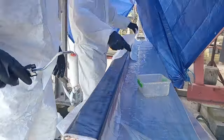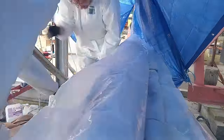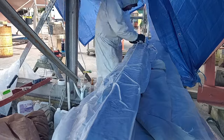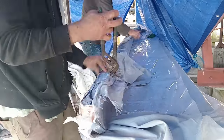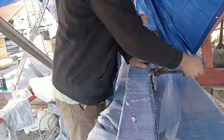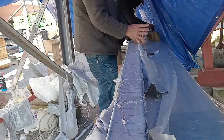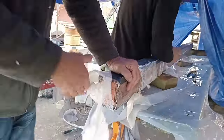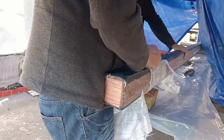This is sped up 30 times and heavily edited — it actually took an hour and a half. The vacuum is on. The idea with the grey cloth is to allow the vacuum to suck the excess epoxy out. It's just an ordinary shop vac — I stuck it in the bag and taped around it, then left it running for a couple of hours while the epoxy set. Next morning — time for the big reveal. The cloth I'd used wasn't particularly suitable and it was a lot of work to rip it away. It turned out I'd done it wrong: the layer of double-biased glass had laid down really well, but the carbon on top of that had a few wrinkles and voids under it. Very disappointing.